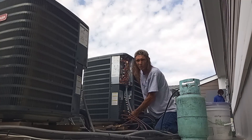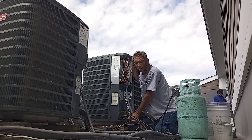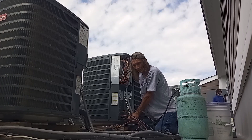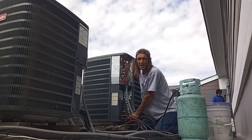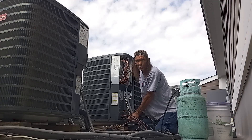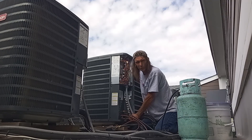What we're trying to do is speed up the amount of time it takes for the expansion valve to readjust and for the liquid that's in the accumulator to boil off to a decent extent — do in two or three minutes what could take 20 minutes or half an hour. Starting to get a little bit of heat on that liquid line now.